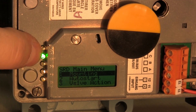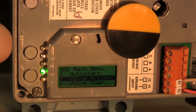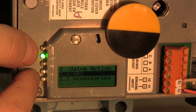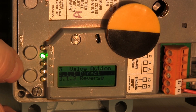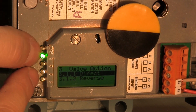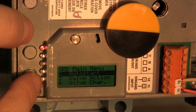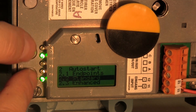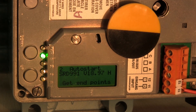Then we press the down button to navigate to valve action. When valve action is highlighted, select up and down buttons to enter. We're going to select SRD menu 3.1 and pick direct acting — so as our 4 to 20 milliamp input increases, our valve position will increase from 0 to 100%. Select up and down to confirm, then hit the menu button, go to auto start, and press the up and down buttons together to enter the auto start menu. Select standard auto start and press up and down to begin.